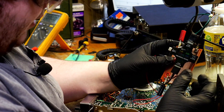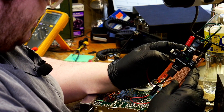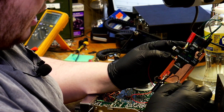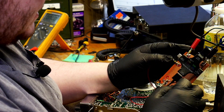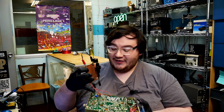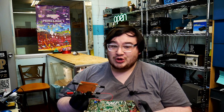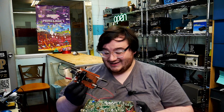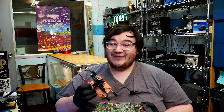So this jig might not work the way it should — I could probably do some improvements — but it was really just to prove a point to show how much current this little circuit is drawing. So far, what I'm able to measure is it's right at about a half amp max. So what is the likelihood of this pot burning up over a long-winded talk? Not likely, especially at a half amp. It's really not drawing much current, even though my perf board jig thing is not done super well, but it is what it is. If you enjoyed this video, consider subscribing.